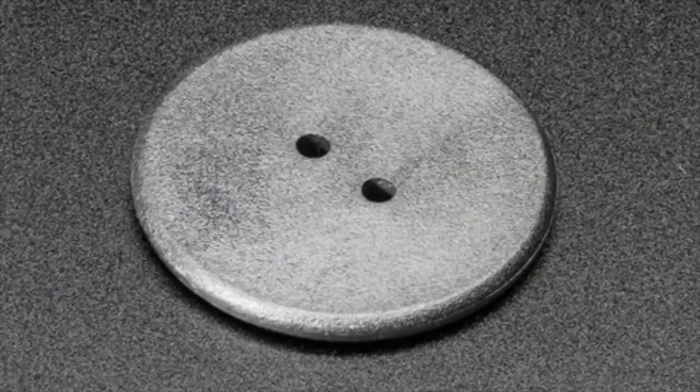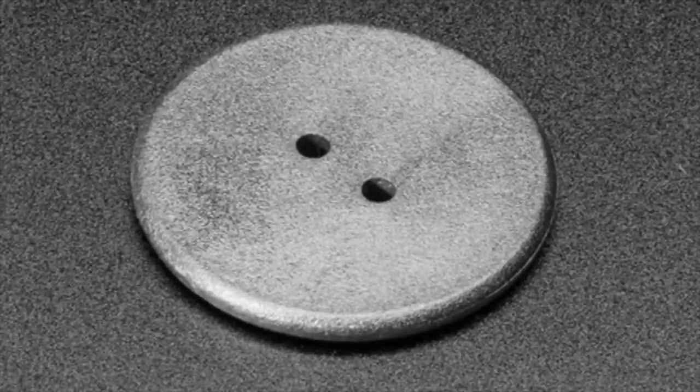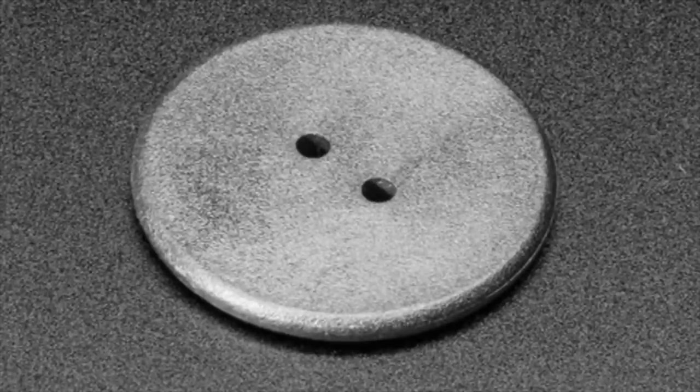As far as physical things that you can buy right now — a button. This is an NFC and RFID tag button. It's an RFID tag that has two holes in it so it can be sewn on. It's actually kind of designed to be a laundry button, so you can sew it onto a laundry bag — that's how they identify the bag, because it stays with it and you can launder it or attach it to some fabric thing. It can survive very hot water, up to about 200 washes. It's very durable. It has two holes that make it easy to mount. It's an NTAG213 — a modern NFC tag. You can store some data in it and read it with a wireless reader. 13.56 MHz RFID NFC. Sewable button, NTAG213.